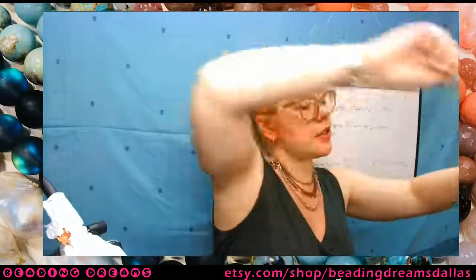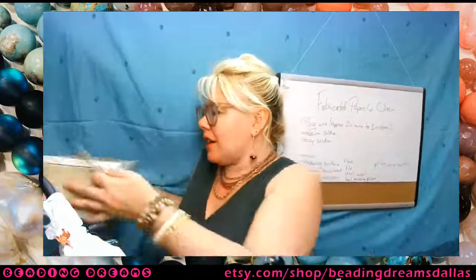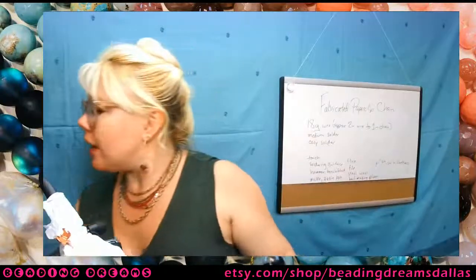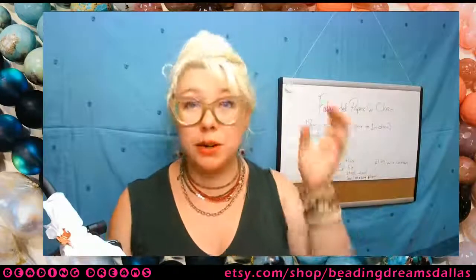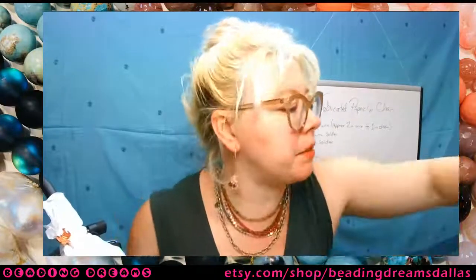So let's talk for just a minute while that's pickling about what pickle is and what it does. Pickle is a weak acid solution. What it does is it cleans all of the crud off of your metal. So all of that oxide, all the flux residue, all the black stuff and gross stuff. What in the world is going on with my hairs? Goodness gracious. Yeah, it cleans all the black stuff and gross stuff off of your metal so that you can polish your metal and make it pretty.